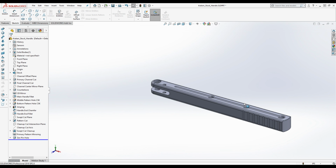What you would do is you would take probably a triangle. I would need a microscope to really see for sure. But you would take what is likely a triangular profile and do a swept cut in a circle, then you would pattern that. It would just take some practice. But at best, your best bet would actually be to count the number of patterns there and measure from one end to the other and then divide it out to figure out the approximate spacing.